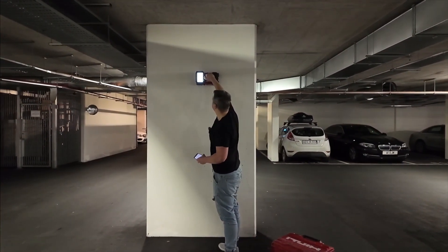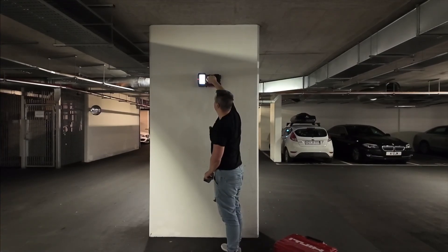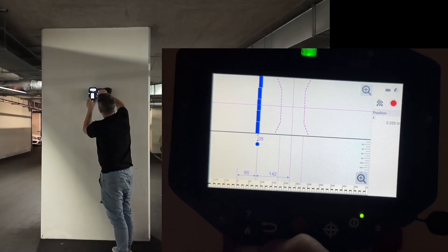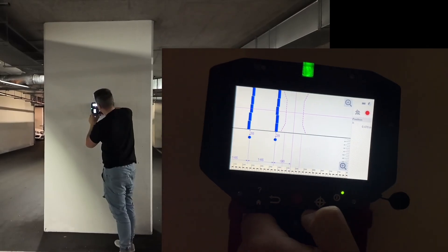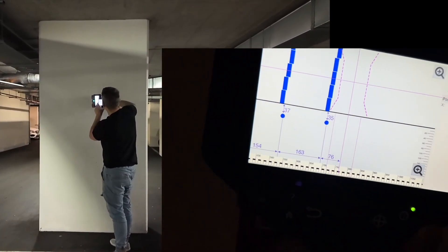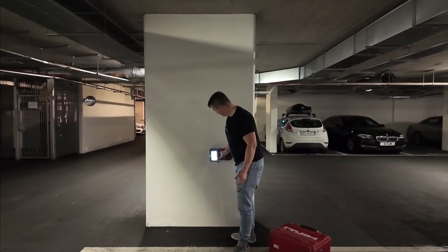Holding it here nicely, pressing the red button. The green LED light on top tells me I'm not on the rebar. As I cross over, you'll see the red light — yes, that's the rebar. We can mark it wherever we like and we have live information about the cover as well. I'm going to go down — 36 — and I can take the scan up again and start scanning, going all the way down to see what's happening.